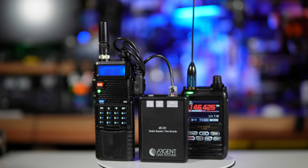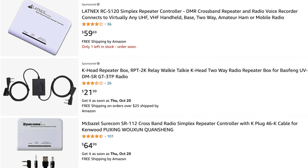But how I use it is in its bulletin system. With the bulletin system, I can have this connected to an HT, and then using another HT in the field, I can send it a DTMF tone. That DTMF tone will tell the device to play audio recording one or play audio recording two, and then it will transmit via the HT that previously recorded audio track. You can also use this as an intermittent audio player for pre-recorded messages, which is kind of nice. There are many simplex repeaters on the market, but this one is the high-end version, and I got it because of that broadcast functionality.